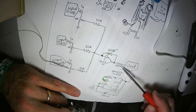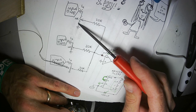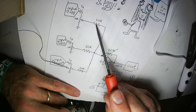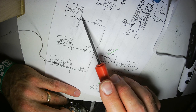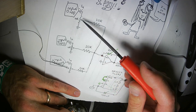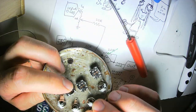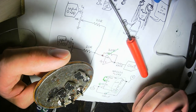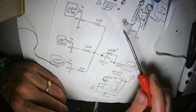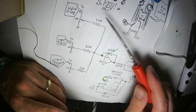When you're working with an inverting amplifier, the impedance is important, because if you have a 1 meg potentiometer, for instance, then the resistance between the feedback resistor and the input resistor is drastically changed when the wiper goes along the potentiometer. In that case, the amount of volume change between all the way off and just a little bit on is quite drastic. All the way up and then a little bit down. So go ahead and try to make the value of your potentiometer in this particular circuit be less than the input and feedback resistors that you're going to build your circuit with.